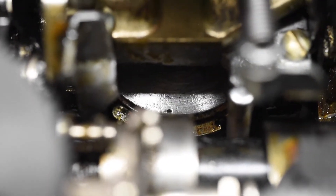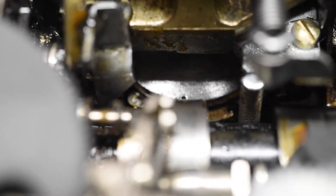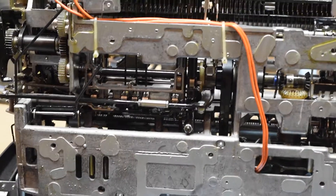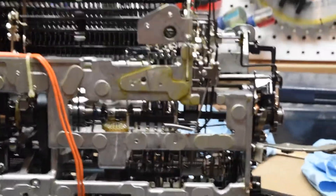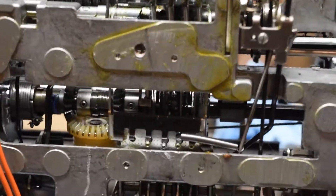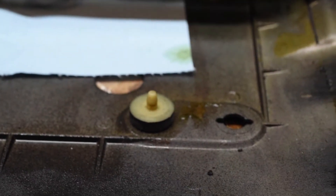That would then go inside of the carriage and connect to that disc. Replacing these is actually kind of tough but it is doable. If you see one with a broken tape, tapes can go anywhere between $5 and $15. You can actually lift up the whole machine and work on it from underneath as well. As you can see, there's quite a bit of oil in a number of locations, but you'll probably have to keep cleaning as you keep oiling it. Oil will fall to the bottom — that's also one of the reasons why when you get them they'll have an actual foam pad glued to the bottom. I would remove these right away, especially the bottom one. It will be impregnated with oil and will usually turn to tar.